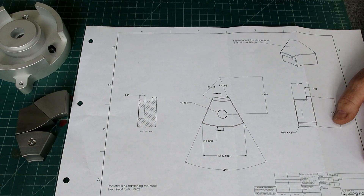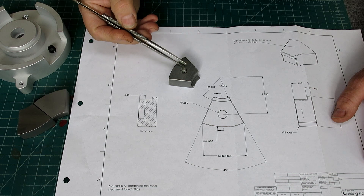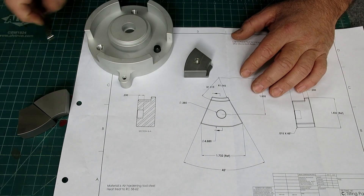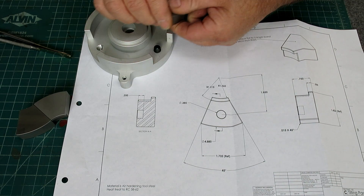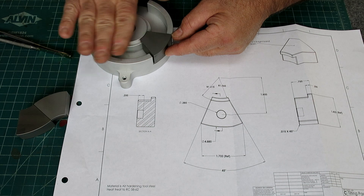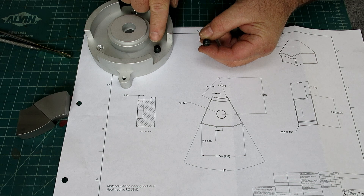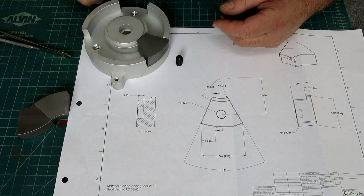Here's the drawing of the tilting pad, and here are some completed ones. I did make a little design change part way through the project. The video that I shot of machining these shows a spherical seat, but I since changed that to a flat bottom pocket. I had a loose ball in here that this tilting pad can pivot on and seek its relationship with the rotor. I changed that to a spherical-tipped set screw that I can change the height on pretty easily. It's more captured and there's fewer parts — a subtle change.